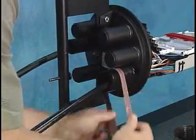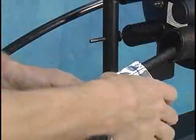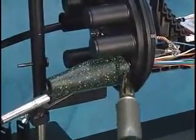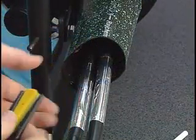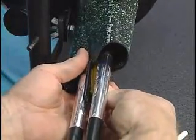Sealing the cables into a port involves scuffing the cable and base to enhance adhesion, adding aluminum tape to protect the cables from the heat, and heat shrinking the cable seal in place. Note that when two or more cables enter a single port, such as the case with the main feed-through cable, it is critical that sealing material is placed between the cables.